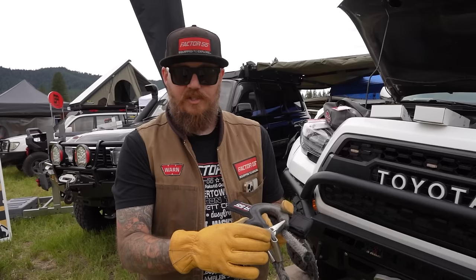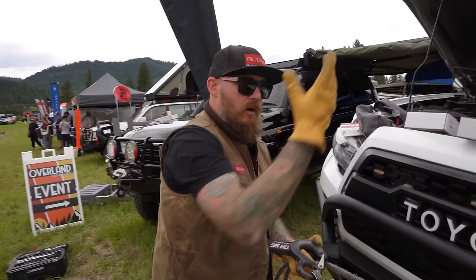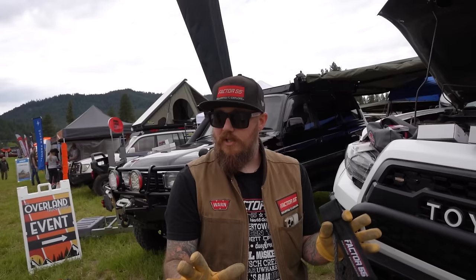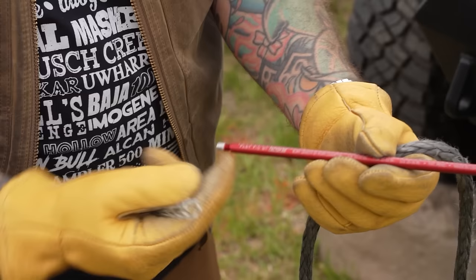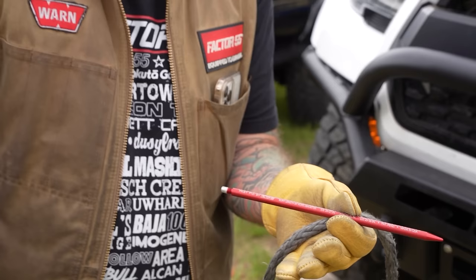We're going to re-splice the end of this and put on one of our synthetic rope spools. This synthetic rope spool gives you a slightly bigger diameter than just the pin of our winch line shackle. This right here is our Fast Fid — we released this tool just over five years ago. You can even do this with a big paint pen and some tape, but this makes it one tool with nothing additional needed to splice synthetic winch line. It comes in a USA-made pouch. On the fid needle, you have a measuring tool and the diameter of the rope, and how deep you should bury the splice. For a three-eighths diameter line like this, it should be buried 20 to 27 inches down the rope — about three fid lengths.